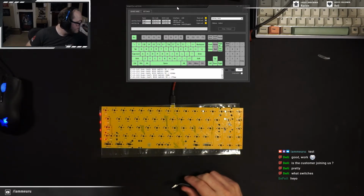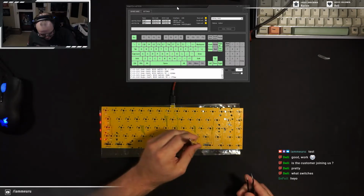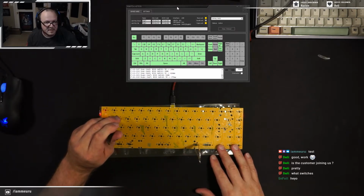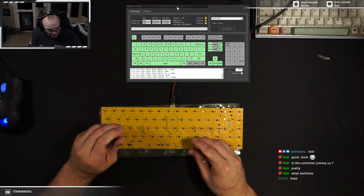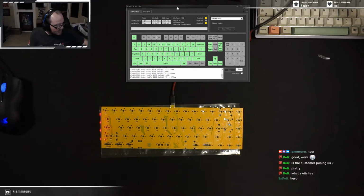Okay. And then, in order to check the functionality of that function layer thing, we'll do something funny like bridge it, and then start trying to actuate other things. Yeah, and so we saw the mode change on the LEDs, so we know that function layer works, right? Pretty easy.